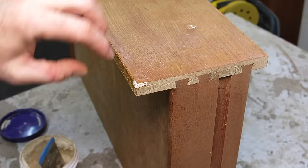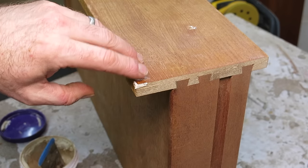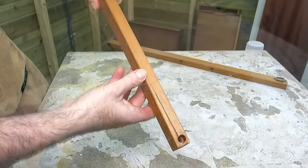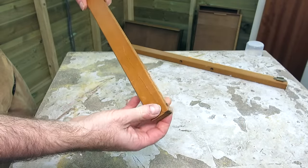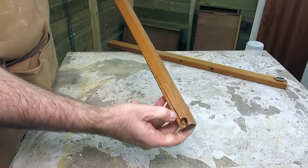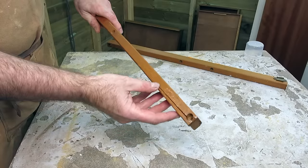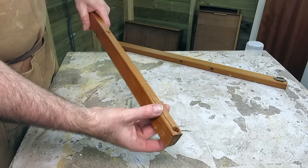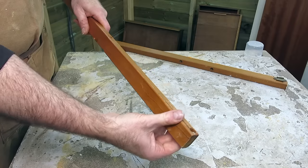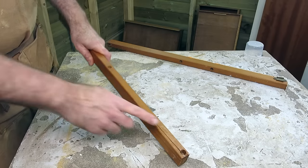Just need to prepare this. I think I showed it to you earlier - when I took the paper off this one, it must have been damaged already and it's pulled this bit of veneer off. We can fill that. That's with the masking tape off so it keeps it fairly neat - just push that out a bit, there we go, slip down, let that dry, shape it up, should be fine. As you can see it's cracked and it's had a previous repair - it's glued quite well. I'm not too sure why they didn't sort of clean it up. So I'm going to try and heat it up to see if I can release that glue a bit, clean it out and re-glue it.